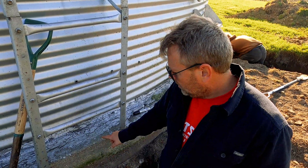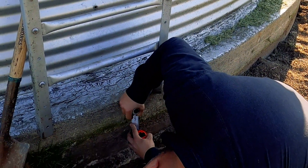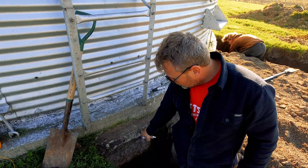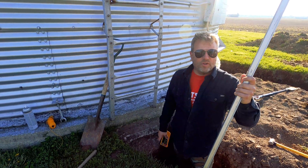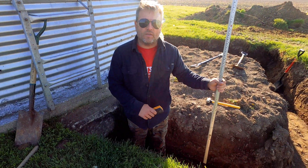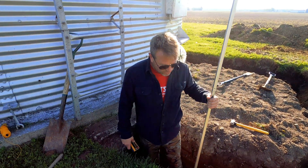This cap will probably have a little bit of fall to drain away from the building. For my footing, to lay my block, I need to come down four inches for my cap — that's my overall top-of-block height. I'm going to lay two courses, so I'll measure down 16 inches and that'll be the height of my footing — probably leave it just a quarter inch low. We've got our laser turned on to establish height with our grade stake for the top of our footing, so when we pour we can just shoot the top and drag the concrete to level. We'll also drive in our vertical rebar stakes and tie off our rebar, making sure it's roughly centered in the footing.